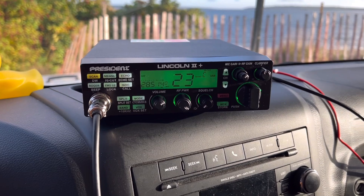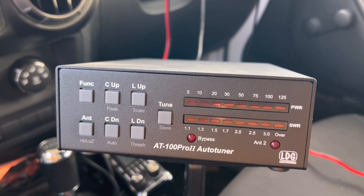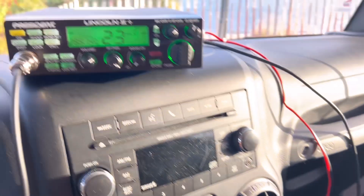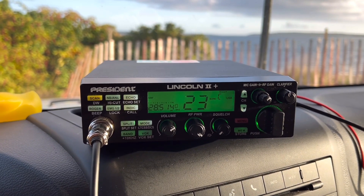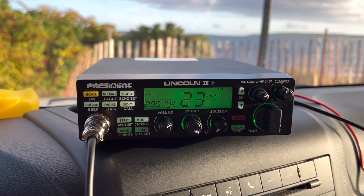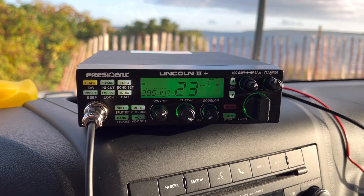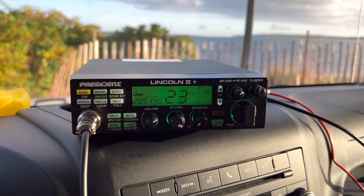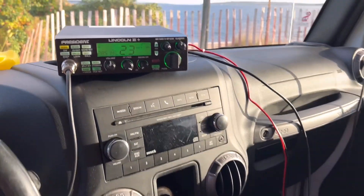I'll see how close I was. I want to make it perfect. With this tuner too, I'll be able to use different antennas that require a tuner with other radios. I've just got a feeling SWR should be pretty good, probably 1.3 to 1 or 1.4 to 1 with the dipole. Feed point impedance for a dipole is somewhere around 70 ohms, and with 50-ohm coax, there might be some play there. I trimmed a dipole, but I'm being lazy and don't have much time. SWR was about 1.7 to 1 — would have worked, but I'm going with the tuner. Let's dial it in and make it perfect.